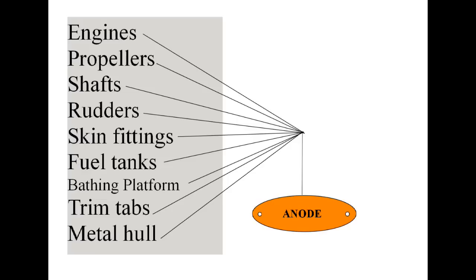To minimize corrosion in metal hulls we attach multiple anodes directly to the hull. In non-metal hulls we electrically bond together the hardware, and using the central bonding point we add the anode to the circuit. In either case the anode eventually sacrifices itself, protecting the other metals. When the anode is gone, the next most anodic metal will corrode.